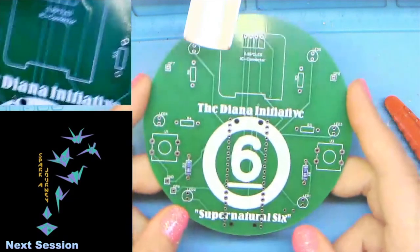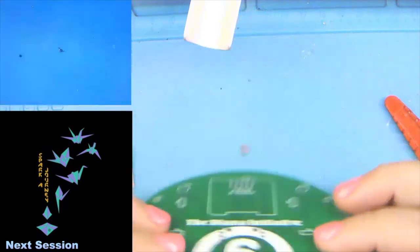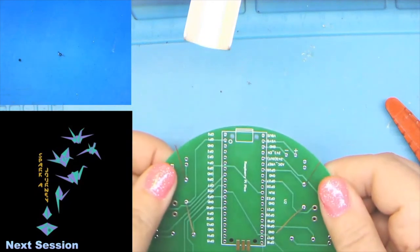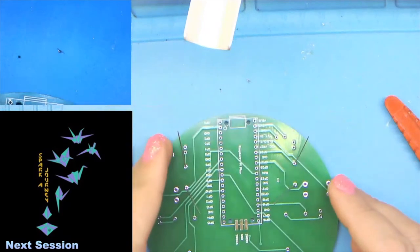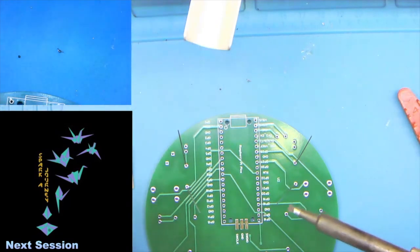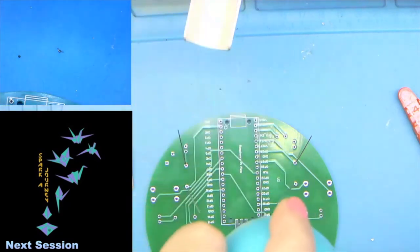So we've got our two resistors. We've bent them up. We've put them in the holes. Make sure they are flat to the board, and you can bend the rear legs out a little bit to help hold them in place. And then when we go to solder, first thing we do is we check our iron, make sure it's shiny, shiny, shiny. And if not, give it a quick clean. If it's a new iron, I recommend tinning it, which is basically we're just going to put a little solder everywhere and then clean that off